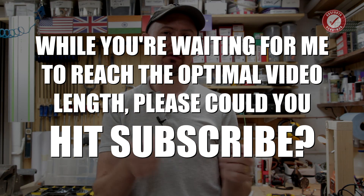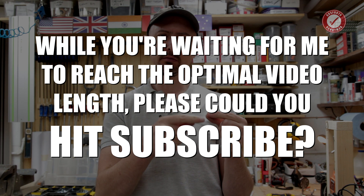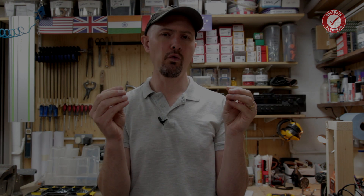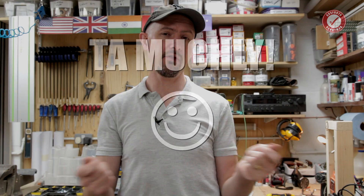Because on one hand, there's less material to screw into because you've removed some with the pilot hole. But on the other hand, the thread is probably getting a better grip in the hole because it's not having to squash the wood out of the road, since you've already removed some of the wood with the pilot hole.